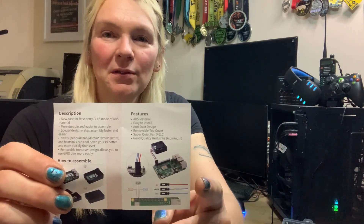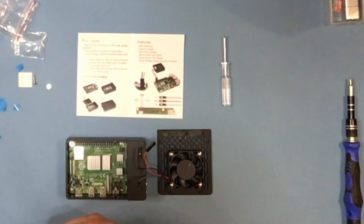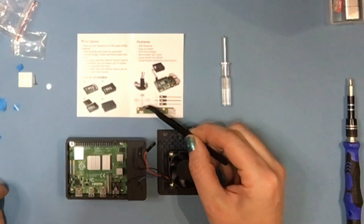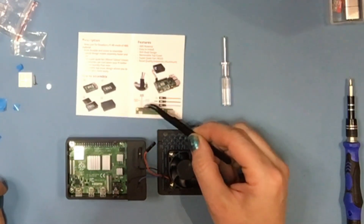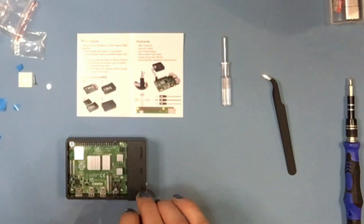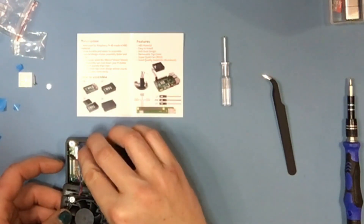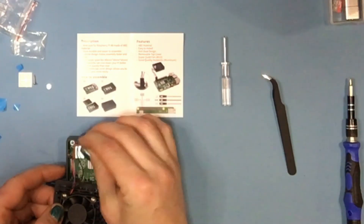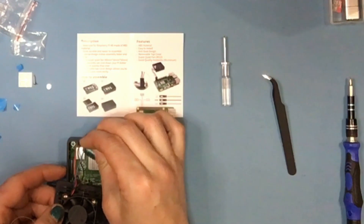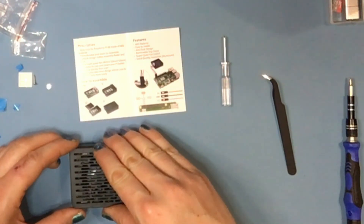If you're not sure where exactly on your GPIO you're going to plug your fan headers in, the kit gives you a nice little diagram — they've made it very easy. Looking at the diagram, the second pin in is the 5V supply, the next one is the ground, and then fan control. So second one in, then the ground pin, then fan control. That's my fan connections in.